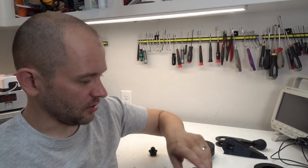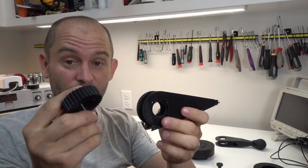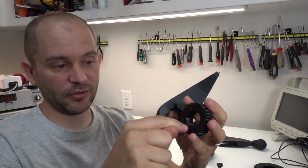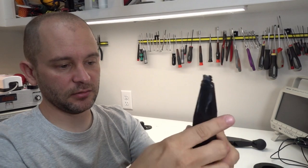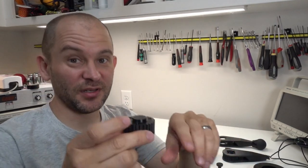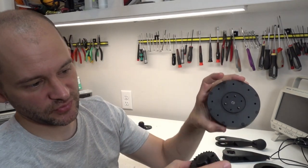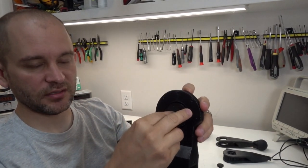The other printed parts are not particularly hard or challenging. This lower pulley goes in the lower leg, and because the leg is printed in this orientation, the pulley has to be a separate part that can be printed flat in the natural orientation. It has M3 3D printed inserts on both sides which slide in, and then you bolt those in before inserting the bearings. The upper pulley is also printed in the natural orientation, and it's bolted on to the QDD100. It has a bearing interface which captures between the upper pulley and upper leg.